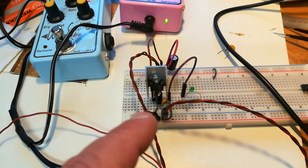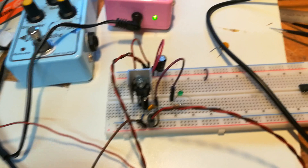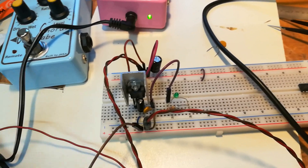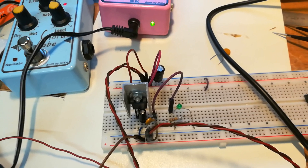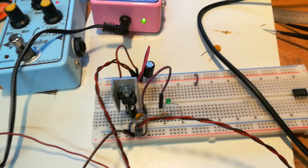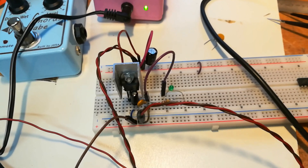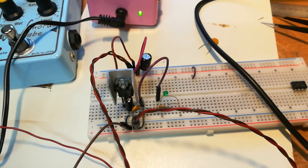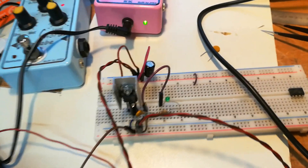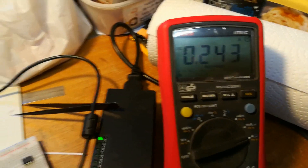You will have to choose very carefully the value of your polyfuse. For a single pedal, you don't need more than 200 milliamps — they will trigger at 400 milliamps and keep a short circuit current of about 100 milliamps, which is nothing your power supply can't cope with. It won't get hot or get destroyed. I hope you enjoyed this little video — see you around!